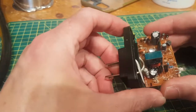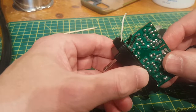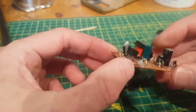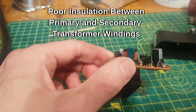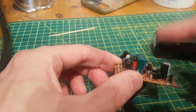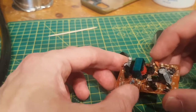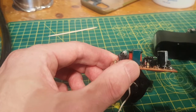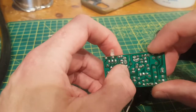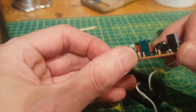Again, the wire has been stuffed in — you can see where it's been pinched — which could equally have gone across and livened up the low voltage side. And look at the state of the transformer — looks like it was wound by blind Pew on a bad day. If you take the transformer apart, you'll often find the insulation tape between the primary and secondary is either non-existent or doesn't go all the way. The isolation is relying on the varnish on the wire itself — and that varnish is all that's between you and the high voltage side. They've made an effort to separate HV and LV sides, but that's a waste of time if the transformer is wound poorly.